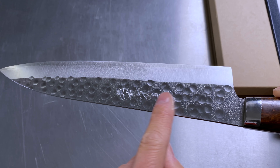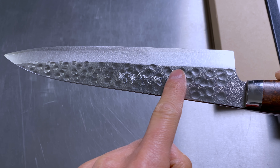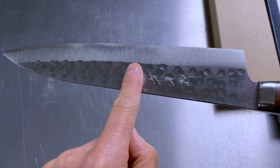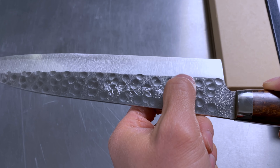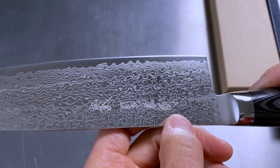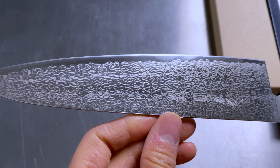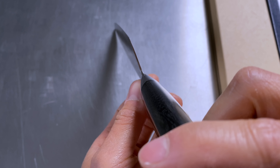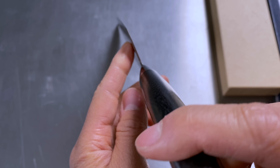The other steel I like at home is SG-2, which is a really good compromise. I don't find the edge on SG-2 quite as sharp as white number two, but it's razor sharp — this Yaxell came out of the factory rated around 123. SG-2 and R2 are also stainless, so for people who want something easy to care for, SG-2 is a great compromise relative to white number two. To summarize: favorite carbon steel is white number two, and favorite stainless is SG-2/R2.